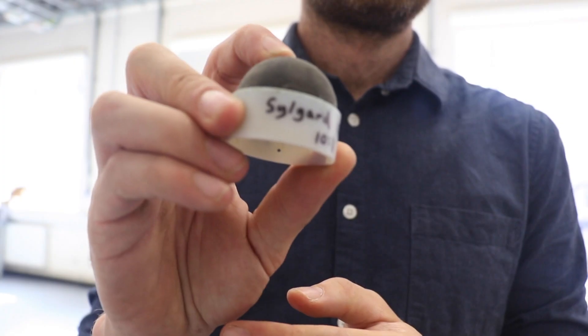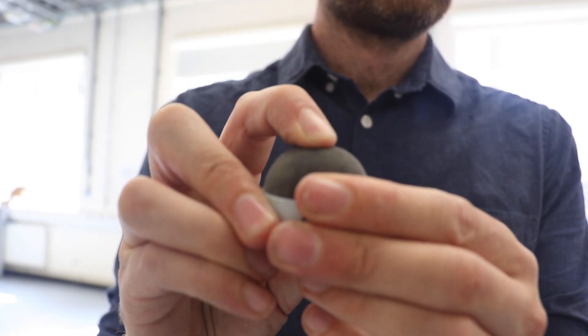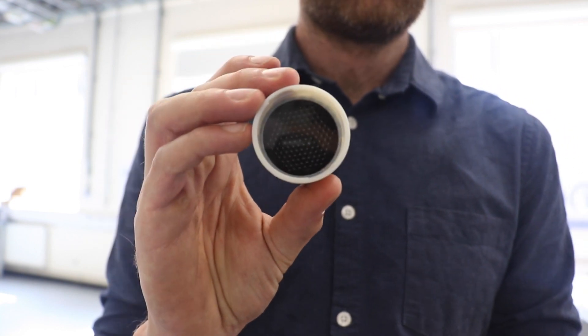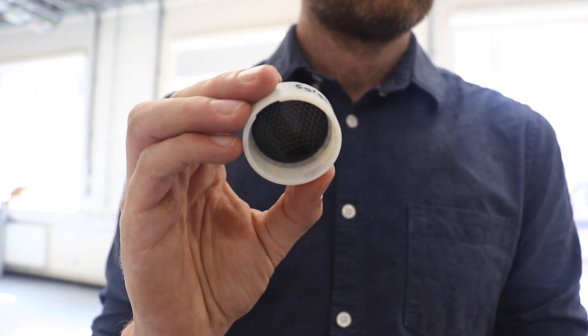The sensor itself is quite simple — it's a 3D printed body, six LEDs, and the insides of a cheap webcam. The interesting part is this: it's a rubber hemisphere which actually deforms around a shape it's touching. On the inner surface are about 127 white dots, and each one of these is the tip of a little pin protruding from the surface.